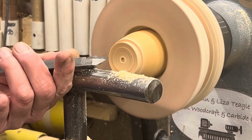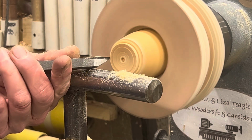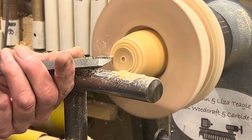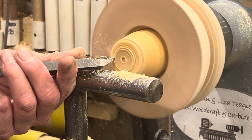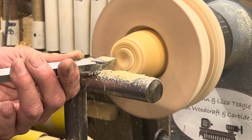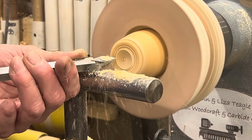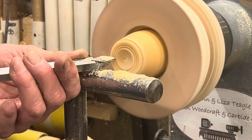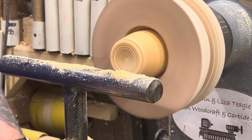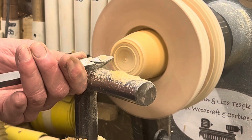Okay, we're going to be very gentle. We've got quite a foot to take off. Cuts go in. I'll come across here. Nice gentle cut. Don't want to knock anything off. And your detail chisel's perfect for this because it takes nice small cuts. It doesn't take too big a bite, see? Although be careful because it can go deeper than you sometimes want it to.